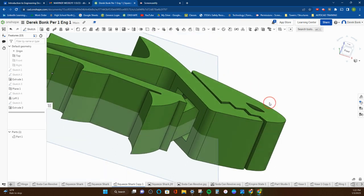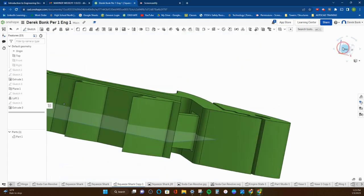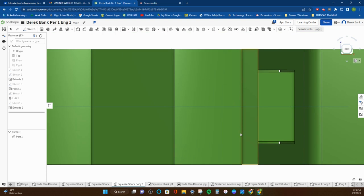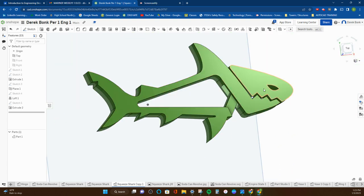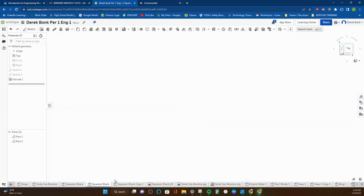So you'll see that that's all workable, and it would 3D print down on its side like this and build this bridging. You can see there's just a little bit of gap. It's actually half a millimeter on either side mathematically in mine. And the 3D print systems actually have the ability to pull that stuff through the air and create gaps like this. And when you pop it off the platform, it'll be a flexible moving toy, which is really pretty neat. Anyway, let's get after it.